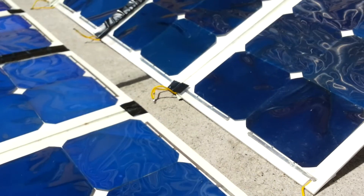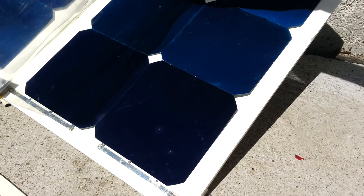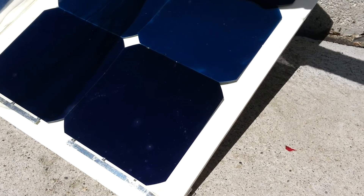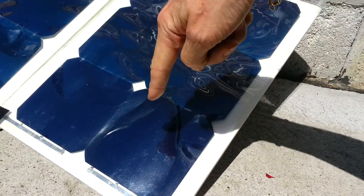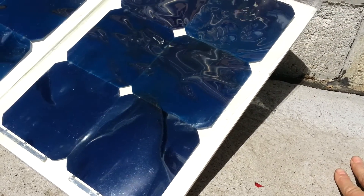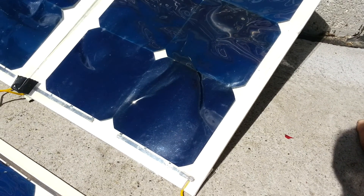It would be nice to use them without this cover. The great thing is the surface is just amazing — how it absorbs all the energy. About eighty percent as heat and twenty percent as electricity. So it would be good to be able to use this heat on the other side — maybe have some liquid flowing behind with a heat sink compound. But anything that conducts heat usually also conducts electricity. I think one of the best substances that conducts heat but not electricity is mica.